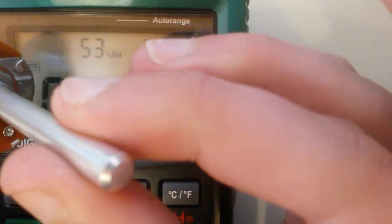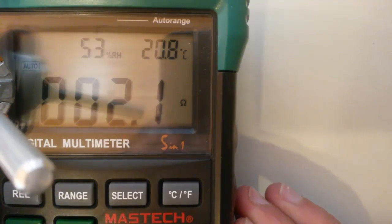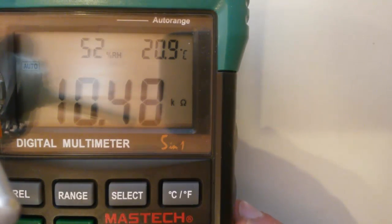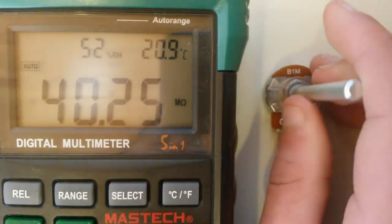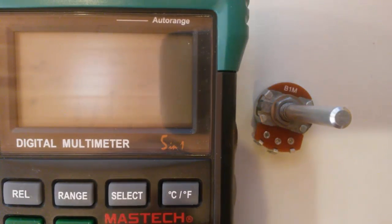Going back a bit to the left — here's all the way left — turning a little bit to the right gives only 2.1 ohms. Going a little more, now we're at 10 kilohms. So as you can see, this potentiometer changes quite rapidly with how we turn the knob. Not all potentiometers are that responsive but I won't get into that in this video. Anyway, that's how we can measure the values of our potentiometer. Let's go ahead and build that circuit now.